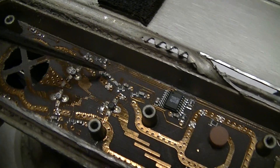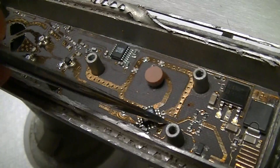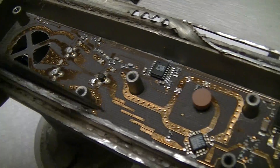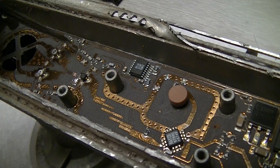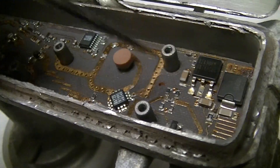A lot of these caps and resistors are 0402 packages. There's stuff that's filtering — that would still be inside the filtering can — all along this really thick trace with all the via stitching. That denotes where there was a filtering can at one time, although that has since disappeared.